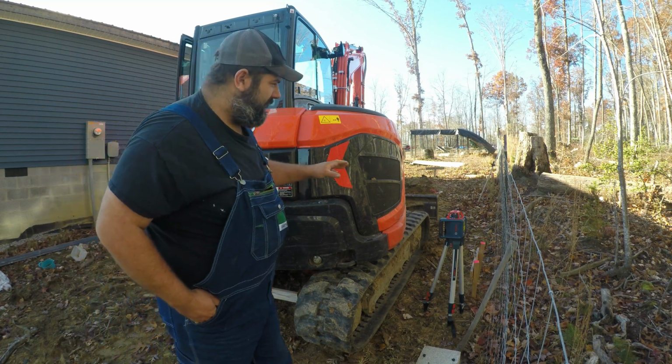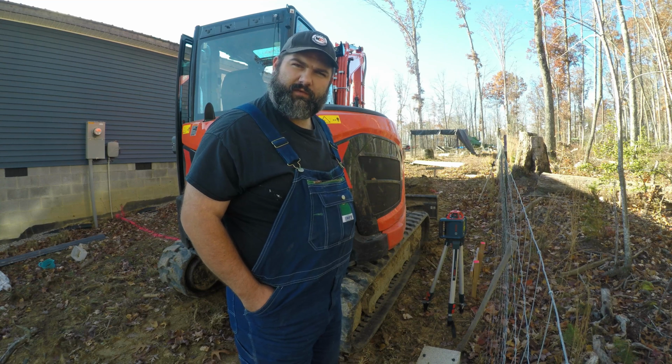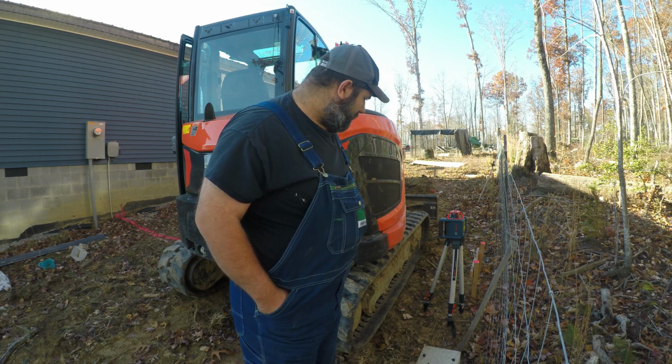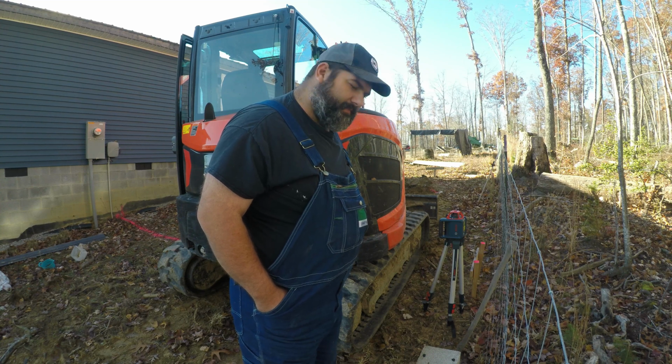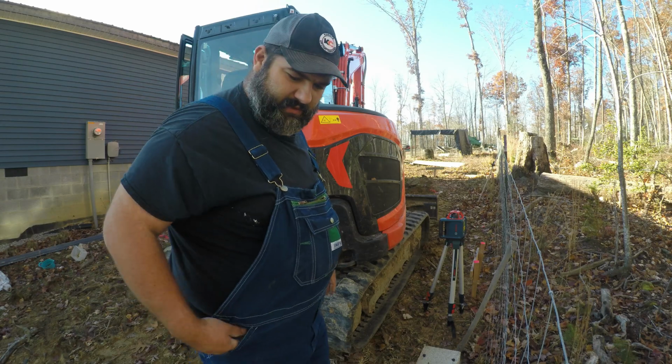So we've changed our depth. We've come to our first step because it's downhill. So I'm dropping the footing 16 inches to compensate for the drop in the ground. I know this view's, let's see, let's move y'all.